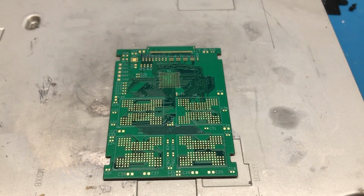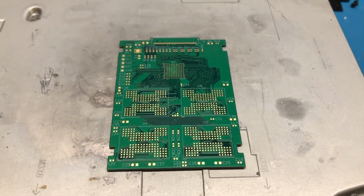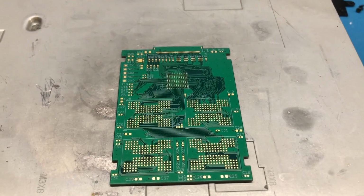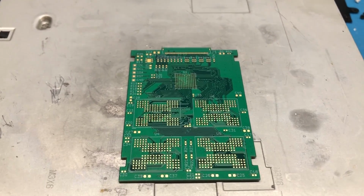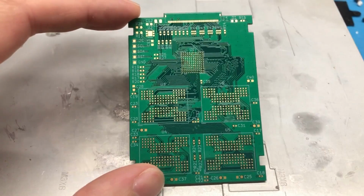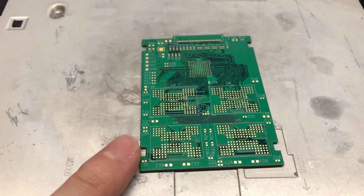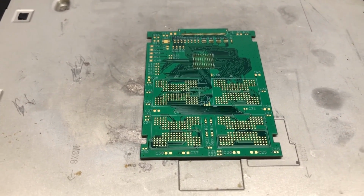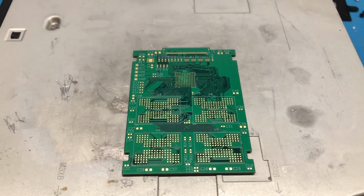In this video, I'm going to be assembling and testing this ZIF IDE SSD that I've designed for use in machines that use ZIF IDE hard disks, such as the 2008 MacBook Air, Sony Vaio UX UMPCs, or what have you. So like I said, this is a custom design that I designed myself, and the reason I've designed this myself is because the only alternative to something like this is a compact flash card, which are ridiculously expensive for some reason, or one of those really sketchy Chinese ZIF IDE hard drives.